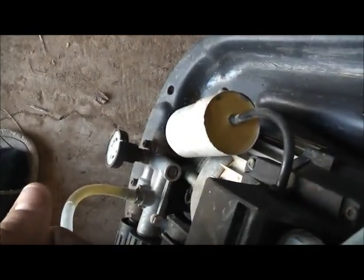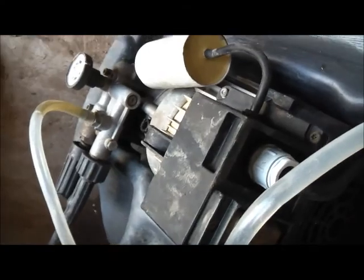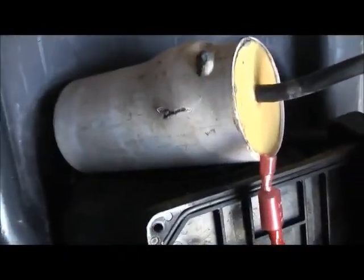It says 400 volt minimum. There's a seller on eBay that sells these, so I'm going to check the wiring of this — if it's the exact same capacitor I'm looking for, I'll just go ahead and grab it. We can't have this thing out of action; it's a bloody good unit, made in 1997. Let's take this terminal cover off and check the wiring. It's got two wires — it's the exact capacitor I'm looking for. This thing let out a bloody load of magic smoke for its size. I can still smell it.